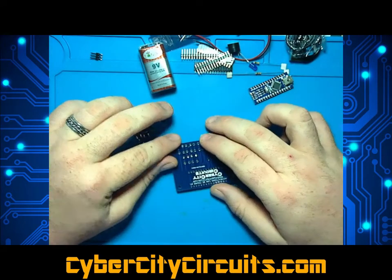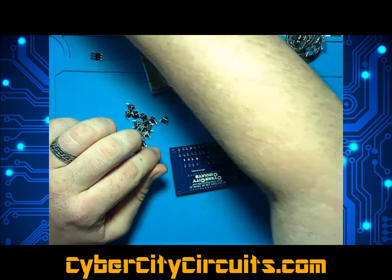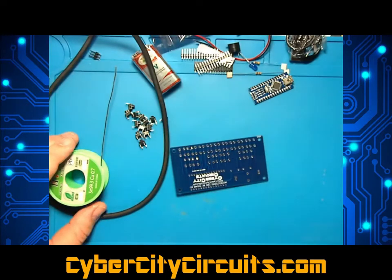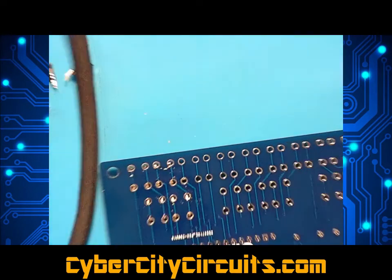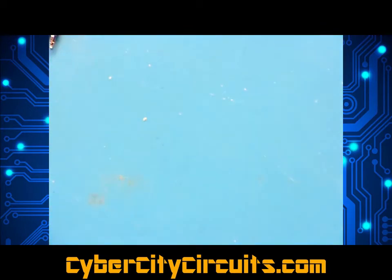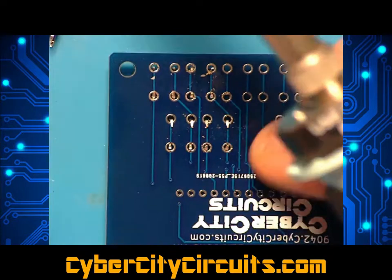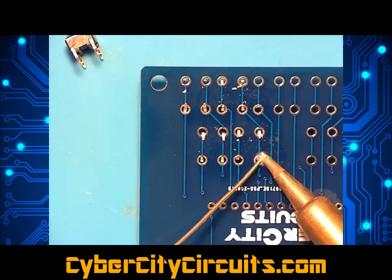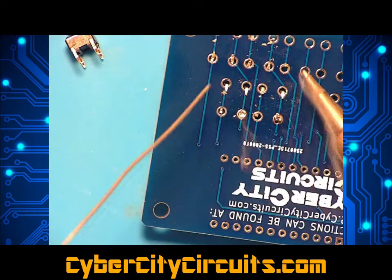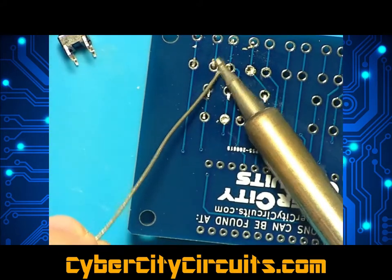So let's take my soldering iron. And these things are a little tricky. So we're going to go over a little bit of some tips and tricks on putting these buttons on. So I have my solder. Let's go ahead and zoom in. And I'll show you what I'm going to do to try to make this a little bit cleaner. And I'm going to solder just one pin on each button. That's it. There's only 4 buttons, so I'm only soldering 4 pins.